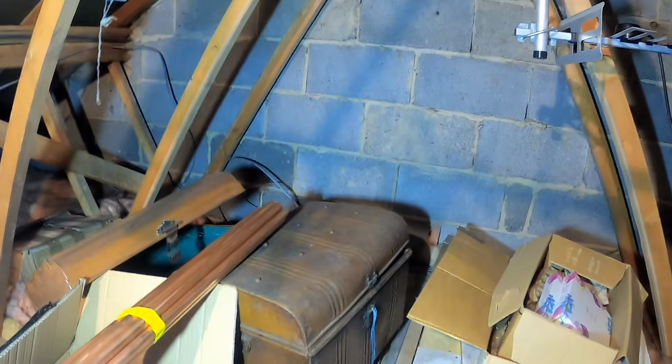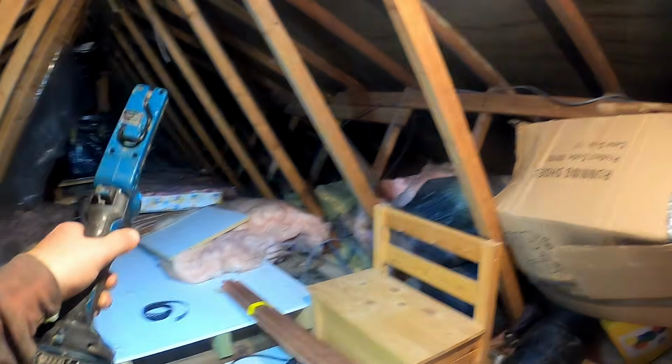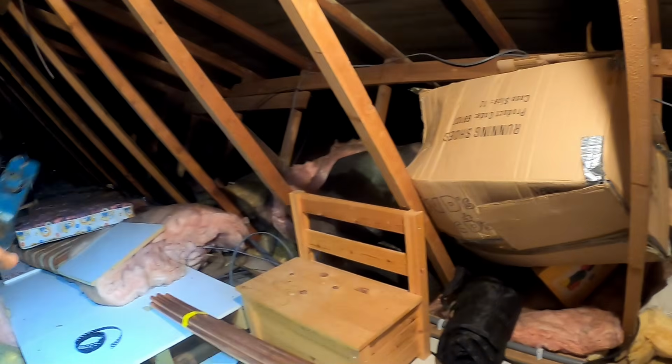So we are here. We're going to start up in the roof on this one. What we've got, combi boiler going over there. Them tanks in the middle will eventually be coming out. We can't cut anything out today because obviously they're using the hot water and stuff still. Cylinder is down there somewhere in the downstairs cloakroom, and we've got a bathroom directly below here, so we're going to have to leave hot and colds off for that. Cold main is coming up over there somewhere, but we might be able to pick it up anywhere over there.